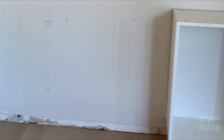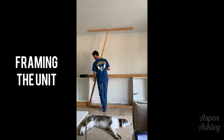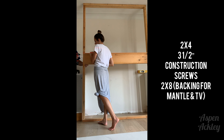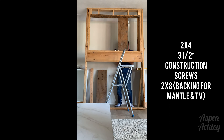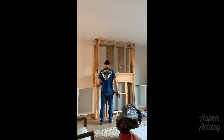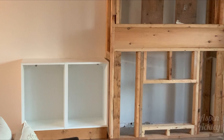Welcome back to our channel. In this video I'm going to give you a step by step of how Andrew built the electric fireplace wall in our living room. We put a ton of planning into this project before we started. It's eight feet tall and around 12 and a half feet wide. The middle is 65 and a half inches wide to fit our 49 inch TV, and the mantle is about 54 inches long and sticks out 18 inches from the wall. We used four Sektion IKEA cabinets with the matte white Axstad door fronts.